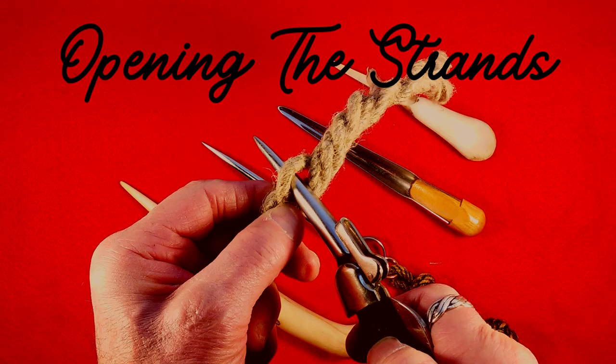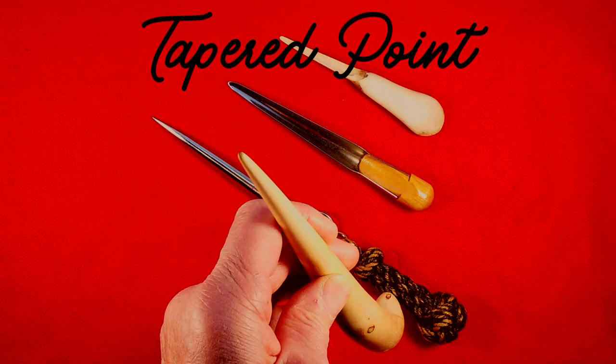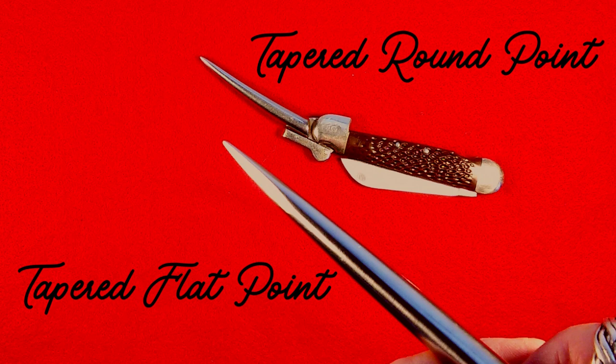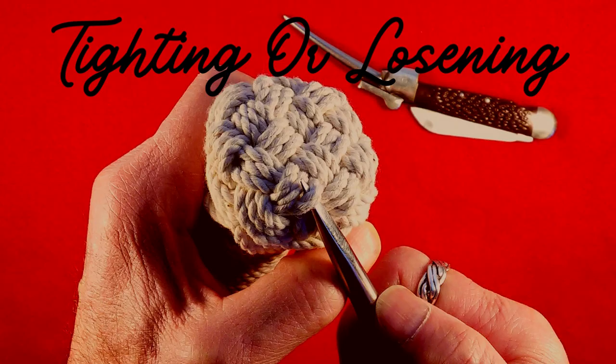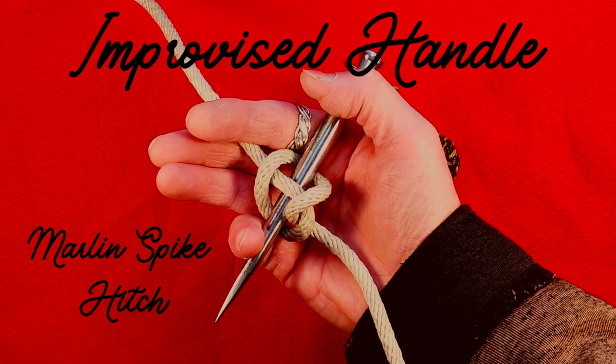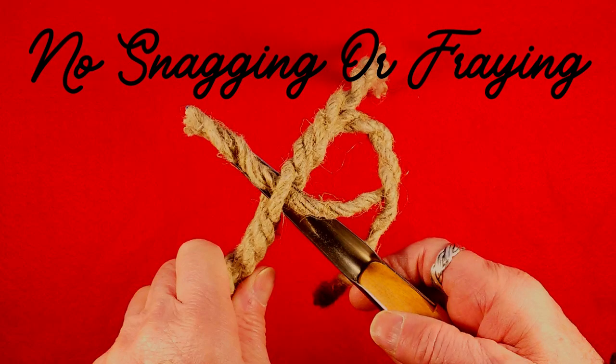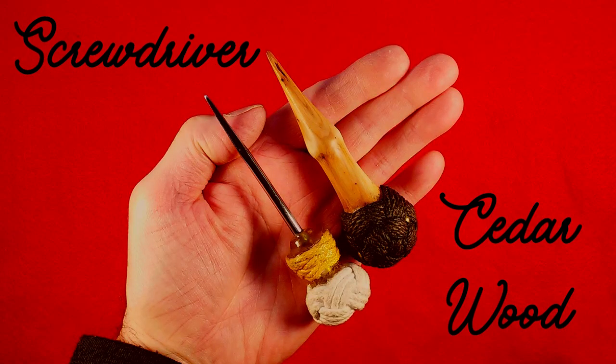They are used to separate the strands of a rope so another strand can easily pass through it. Fids are made of hardwood, antler, bone, and sometimes horn. They are tapered to a dull point and highly polished. Marlin spikes are made of steel and are used for splicing wire rope. They are tapered with dull, flat, or round points and can be used on natural fiber rope, whereas a wooden fid cannot be used on wire. They are versatile for tightening or loosening knots, general splicing, and as an improvised handle using the marlin spike hitch. This is a Swedish fid — it has a stainless steel U-shaped blade and a hardwood handle. A strand can easily pass through the splice without snagging or fraying. They are available in different sizes; this one is for 5 to 12 millimeter rope. Here are two fids that I made: one from an old screwdriver and the other from a cedar wood branch.